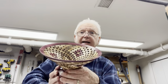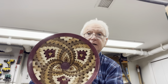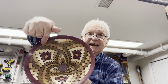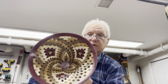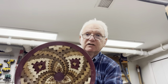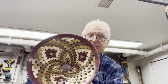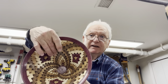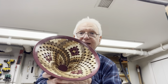From an artistic point of view, I don't take any credit. But this particular bowl has 15 rings of open segments. Each ring has 24 individual pieces of wood that are individually glued. The cap ring on top has half that number — 12. So there's a total of 373 individual pieces of wood here: the base, 12 for the cap ring, and 360 — 15 times 24. You can come up with some pretty interesting patterns.